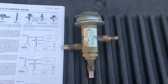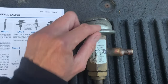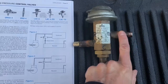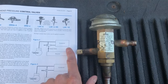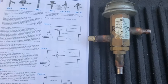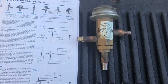In an emergency situation where the valve is stuck and allowing discharge gas through without condensed liquid, you can cut the pigtail — that relieves the pressure inside and allows better mixing so you can maybe get them running through the night. You can also put temperature probes on each line: the receiver side should be a lot cooler than the discharge side. If they're both around the same temperature, you've got a problem. Your discharge line should be warm, not hot. You can also hear it — if it's bypassing you'll hear a hissing sound through the system, audible even at the evaporator.